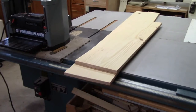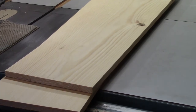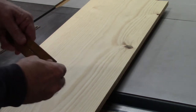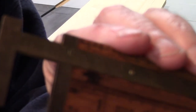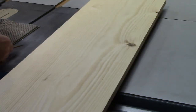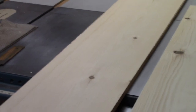Okay, good. So we are flat and parallel on both sides now - both boards are exactly the same thickness, the surfaces are flat and parallel to each other. The next thing we want to do is get to our half-inch thickness. So let's check the thickness of my stock. I'm still at a full three-quarter inch, so now we're going to take her down to a half inch. That's just a matter of alternately flipping the boards - take off a pass, flip it, take off another pass, gradually working our way down to the half inch we're looking for.